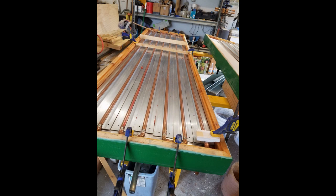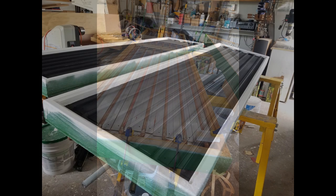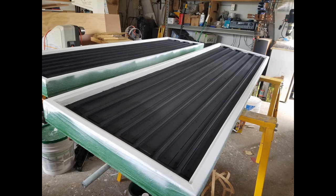Then I inserted two-inch poly-iso insulation in the bottom of each box, which was glued in place. Then I installed the aluminum track with the copper pipe snapped snugly in place. I used high-temperature silicone, which you can buy at an automotive parts store, to secure the tracks to the poly-iso insulation. The entire assembly was then spray painted with flat black high-temperature barbecue spray paint.